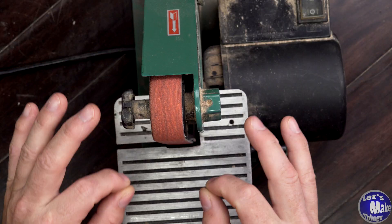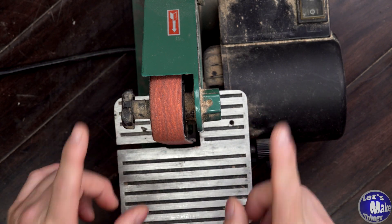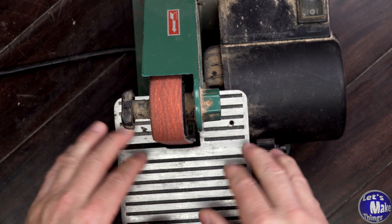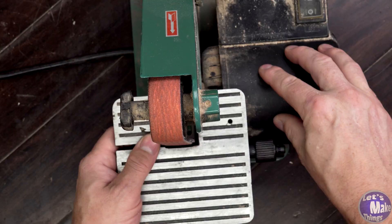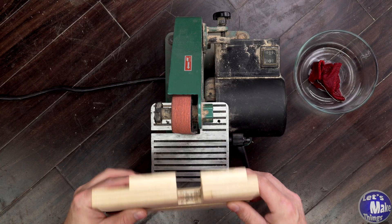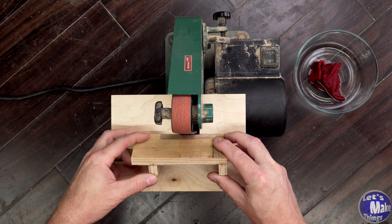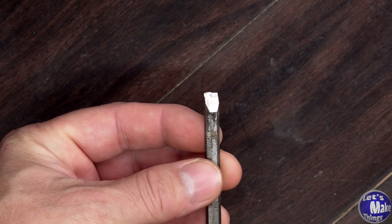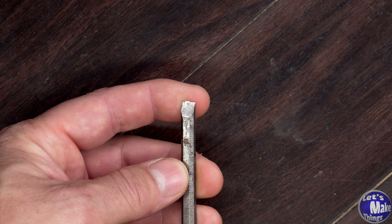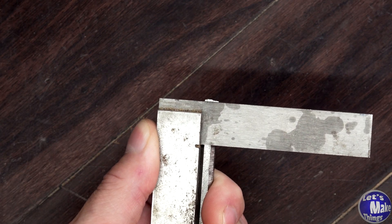You have to remember that we're not trying to reshape the blade quickly — we're trying to do it accurately and cool. If you push too hard, you'll not only generate heat, but you'll flex the table or jig slightly, and that can throw off your geometry. On my belt sander, the table slides front to back — I push mine as far forward as it will go for this jig. Now the jig base slides on and the cradle drops right into place. I've got a really bad edge here on my chisel — at some point I think I tried to sharpen this with my bench grinder, but it doesn't look good. I think maybe I even chipped it out at some point. If I put a square on it, you can really see how bad it is.